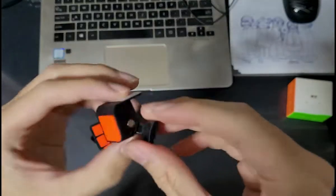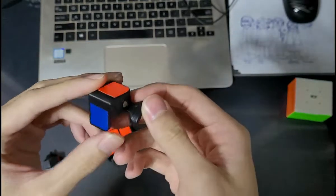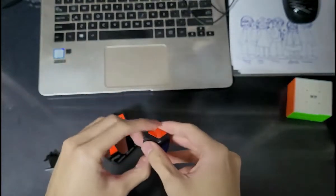But for my FDM puzzle, I definitely have a little bit of this line problem, and I think I can actually minimize this problem based on how I angle the pieces. If I can make the lines parallel to the rotation instead of crossing the rotation every single time, I do think I can get this puzzle to turn smoother.